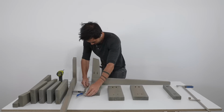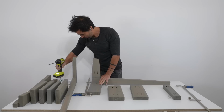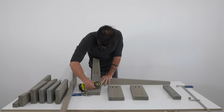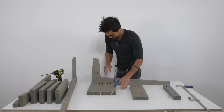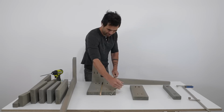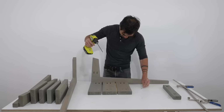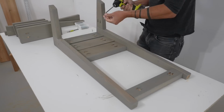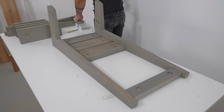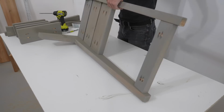Once the stain had fully cured, I assembled the chairs by driving screws through the pocket holes. Seriously, the Kreg stuff makes DIY furniture projects really easy. I used the Kreg clamps to keep the pieces from sliding around. I used some paint stirring sticks to get the spaces between the boards nice and even. From there, it's just driving in screws through the pre-drilled holes.